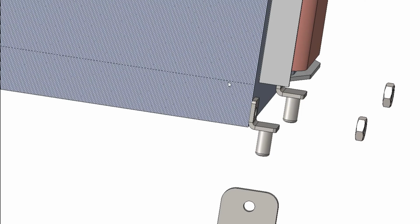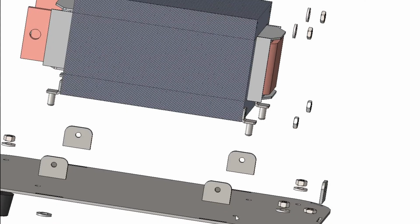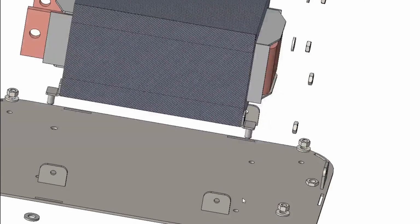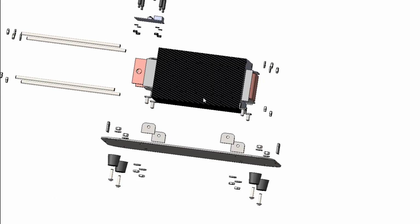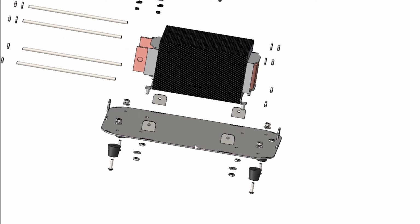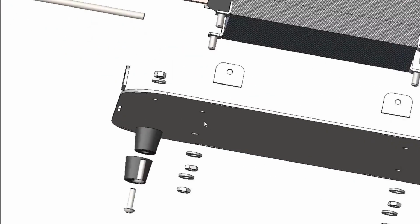Obviously the brackets are not welded to the transformer, but I'm saying this stud, these threads, is welded into the bracket, and the bracket is directly bolted onto these holes on the base. The threaded bar here runs directly through the holes in these wee L brackets, and the nuts and the washers hold the whole lot in place. And the transformer is placed on the base, and these nuts and washers are then used to fix the transformer tight.